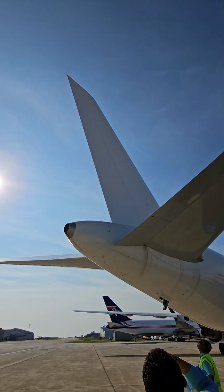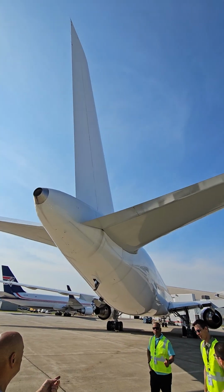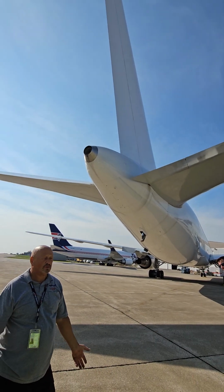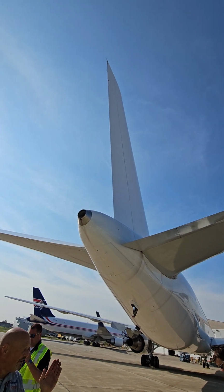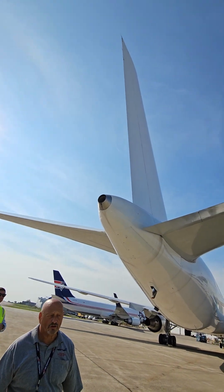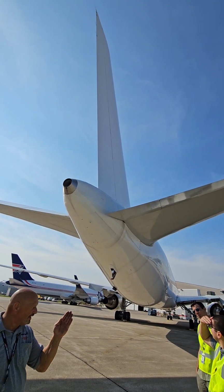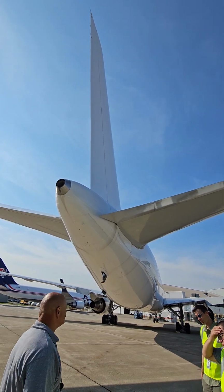Look how big that rudder is. It's enormous. Because it's so enormous, we have something called a rudder ratio system. It is basically a rudder limiter based on speed. So at low speed, I have a lot of authority. At high speed, it only moves a couple of degrees. If that system fails, the QRH says avoid large rudder inputs above 160, and I also have a crosswind limitation for landing, because if I only have this much deflection, because that's where it failed, then I would have a 15 knot crosswind limitation. All right?